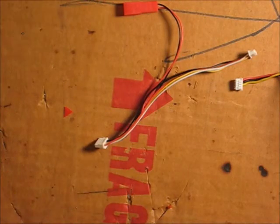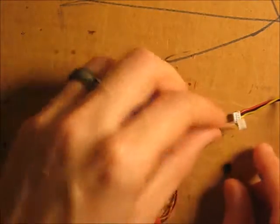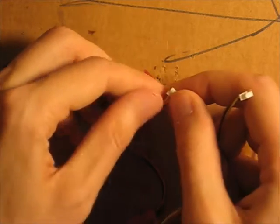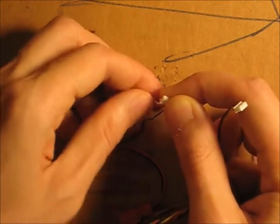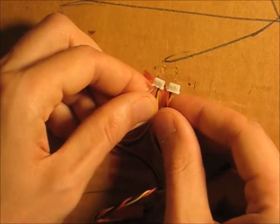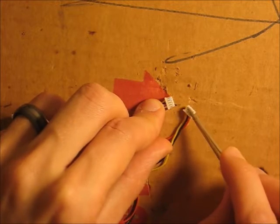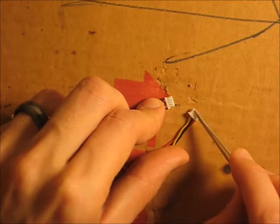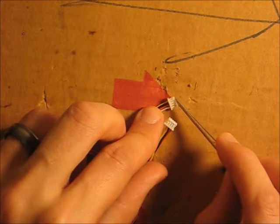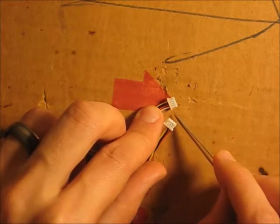This twisted-up wire would work well. This plug will plug into our camera, but if we compare it to the camera plug, those colors don't match up. The camera plug has an empty slot first, then yellow, then black, then red — none of those match up to the correct spots. So essentially what we need to do is remove the audio wire and shift everything over one.